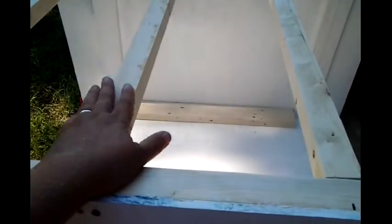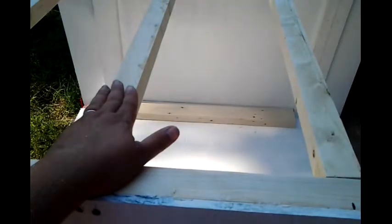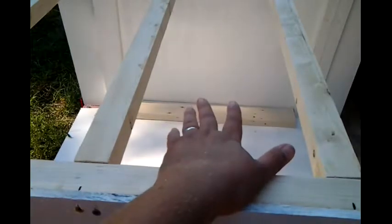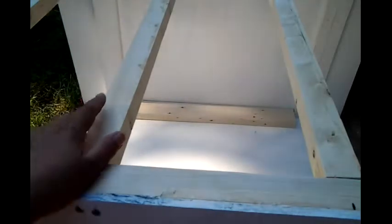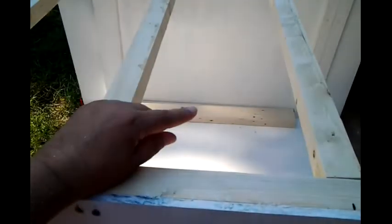to put bikes in there or something else, but I wanted to make sure that the plywood had more support than the 2x2 in the middle, because even though we're not going to put anything heavy on there, I just don't want to risk that. And I'll use the short Phillips head screws to put the roof on top after I do the corners and the front and back. I hadn't done the front and back yet because the paint's much wetter on them.